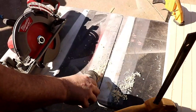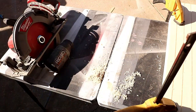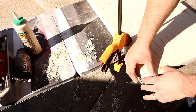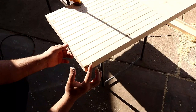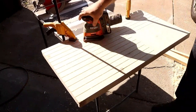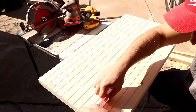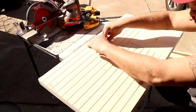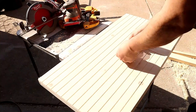We're going to use a planer here — if you don't have one, you can use a sander or a cheap hand planer to clean up those edges and take off that excess wood. We do have a couple dings from planing on the corner. What I'm going to do is take some dust from my sander, mix it with some glue, and fill it in there — it'll dry nice and you can stain over it. Wood fillers don't really work for staining; but glue mixed with your dust matches the wood and allows you to stain over it great.